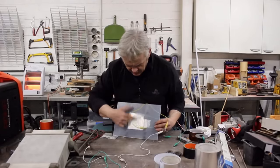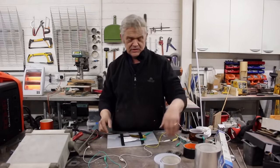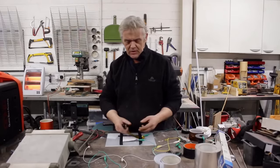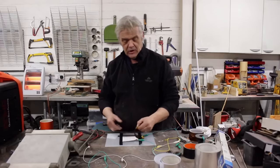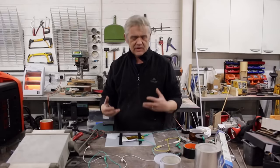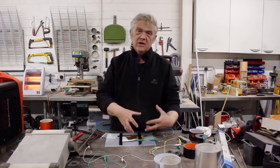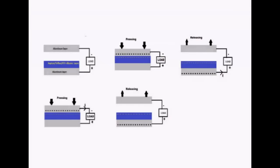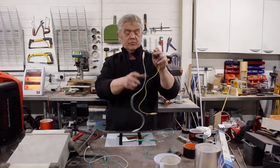So this is a piece of aluminium with some Teflon on top, and I've attached a crocodile clip to it. The opposite material in this case is just plain aluminium. I've put Kapton on it so I can hold it without interfering, and then rub the two together to get an electric charge. This works like contact transfer and produces an alternating current, so we need to put it through a rectifier — I've got a little rectifier bridge with two clips coming off the positive and negative.